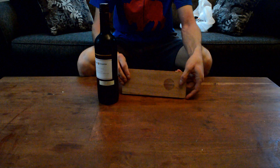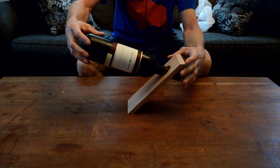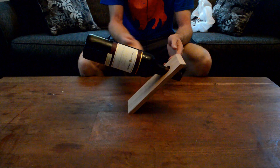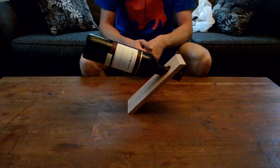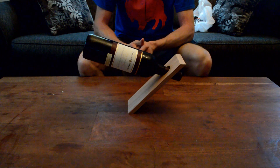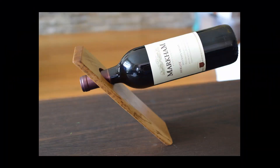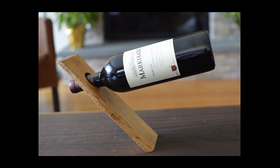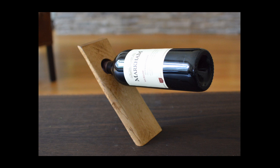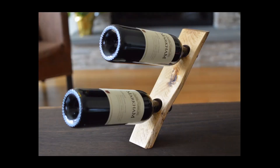Last thing to do is check that this works. We'll take the wine bottle holder that we made, take a bottle of wine, plug it into the hole. With some fine tune adjustments, you can see that it does indeed work. The neck is approximately at the half thickness of the wood as it should be, and the angle of the bottle relative to the table is slight — that's based on the 1.5 inch hole we drilled. You can compare this to the code and see that it's actually quite close. The last thing to do is put your favorite finish onto this piece of wood and you're good to go. Well, there you have it — a simple way to design and build a single bottle magic wine bottle holder. Please leave comments or suggestions and subscribe if you want to be notified when I post my double bottle magic wine bottle holder video. I'll be posting a lot of resources in the video description as they become available. Thanks for watching.